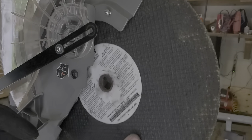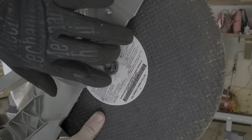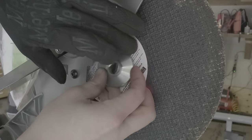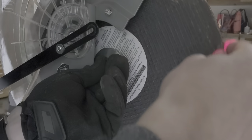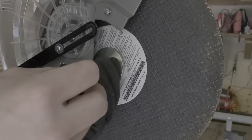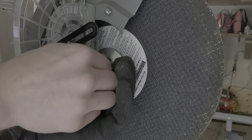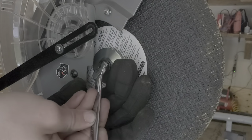Place your little adapter on there, then take your grinder blade and slide it on. Make sure it sits in there nice and flat and square. Then take your arbor and set it in — I put this side in first to pinch against the grinding blade, so you kind of have to hold the grind blade in place. You're going to feel and make sure there's no back-and-forth motion, because any play is going to result in an imbalance once it's spinning at 5,000 RPM. Then thread it in backwards, and screw it all the way in.